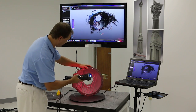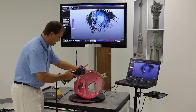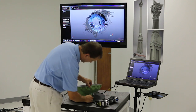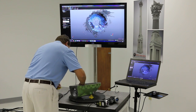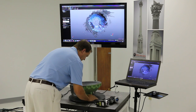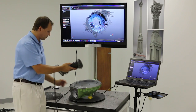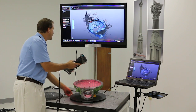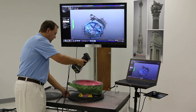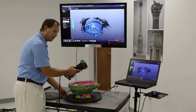I'm going to start slowly moving around and first just scan to grab the targets. You can see the beauty — even though I'm sliding the part all around, it's still tracking everything. I'm going to put my little stands back on the part just to keep it up in the air, which makes it easier later when we edit the data so that the part isn't connected to the table. Even though the part's kind of loose and moving around, it doesn't matter.